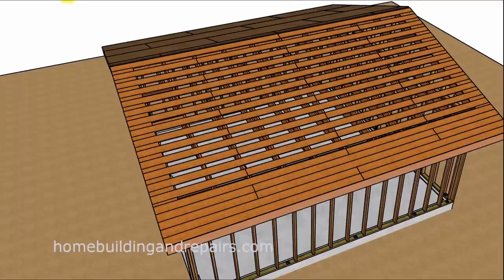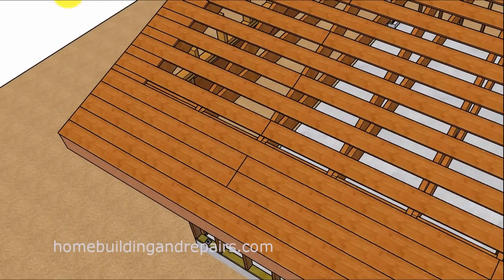Let's take a look at what it would look like. A lot of times they would go 2 boards and then 2 boards, but I've seen them go 3 boards and 3 boards. Two boards is usually the limit before there has to be a break. A lot of people use 4-foot breaks for sheathing, but I used to see a lot that was just broken on the next rafter.